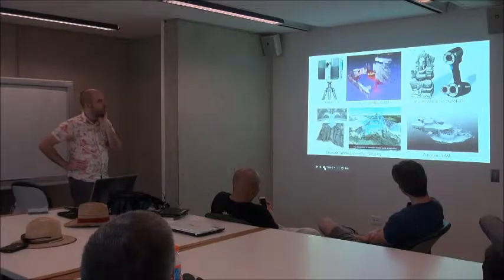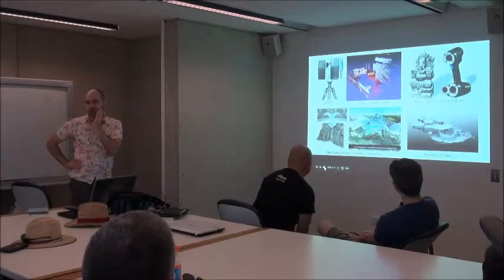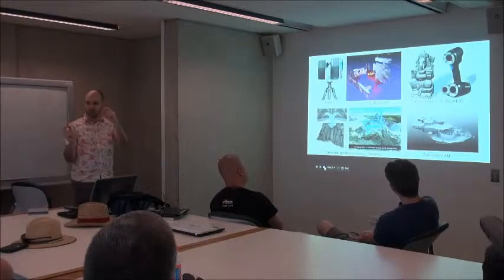The top middle one is some open source. This is more like university research papers into the idea of RGBD SLAM, where there are some sensors which give you red, green, blue, and depth, like the Kinect and the Kinect 2 sensors, particularly the Kinect 2. And there's some work going on where you take the Kinect and move it around very slowly, and it'll give you colour and position, and again it uses SLAM, simultaneous localization and mapping, to match it all together. The disadvantage is that it's not really a commercial product at this stage, and it's slow, and it's to be seen what will happen with that.